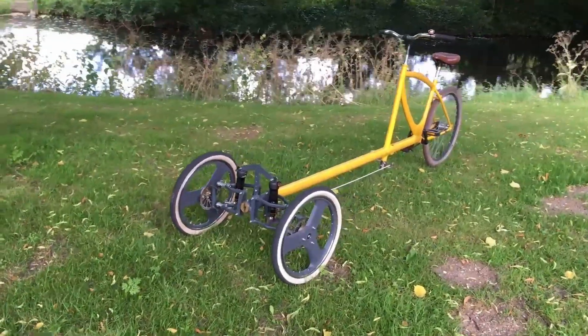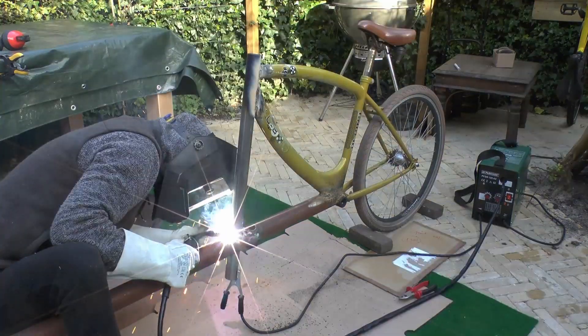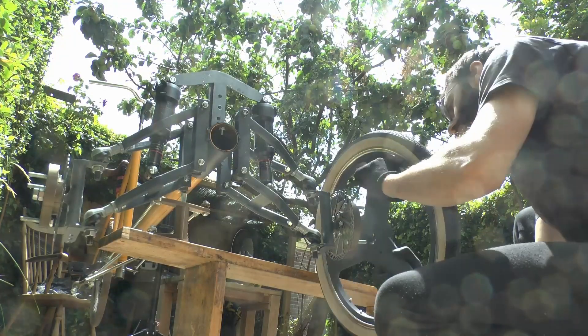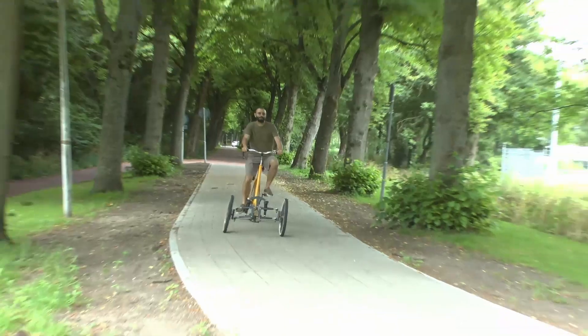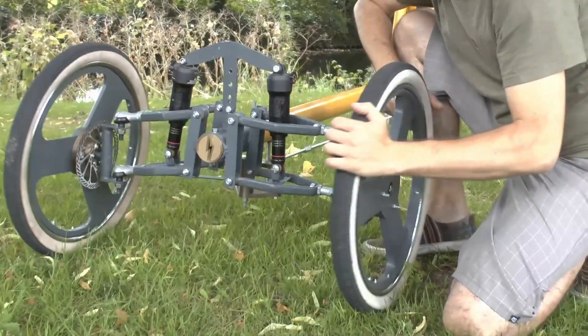With lessons learned from that barely working prototype, I went on to build a real one with most mechanical parts made of metal. I got a new frame and started extending it with my newly bought welding equipment, designed the parts to be made out of metal, and started fabricating and putting it all together. There are still some 3D printed parts — the hubs were quite resilient and I'm still using 3D printed wheels. Once everything was put together I went for a ride, and it felt pretty good — the tilting mechanism seemed to be a win, though there were many things needing improvement.